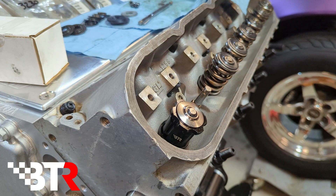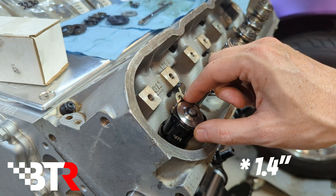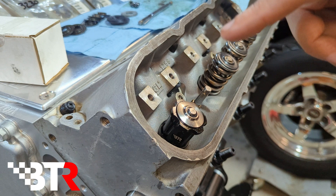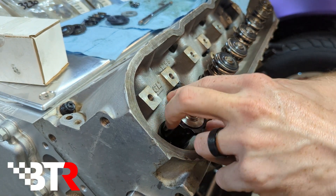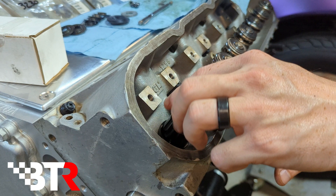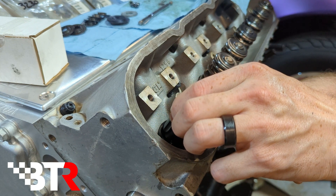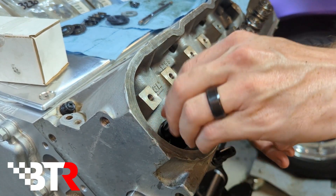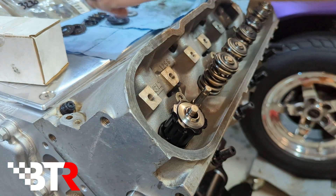What we're going to do — and it might be kind of difficult to see, but on the tool, and I'll show you afterwards a little bit more in detail — there are numbers on here. This is one inch all the way down, and then as you spin it around each time, it goes up one tenth. So we're looking for 1.7 to 1.72. You just hold it here — this thing is really nice and easy to use. I'll turn it so I can see. So there's one time around, we're at 1.5, 1.6... there's 1.7. I'm just barely getting to 1.7, had to turn it a little tight. So I would say at that point it's close to spec, but it's a little tight.